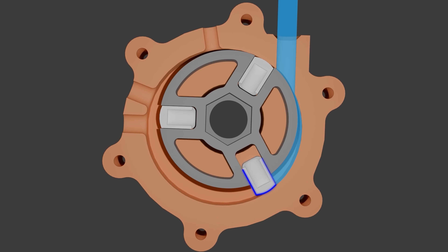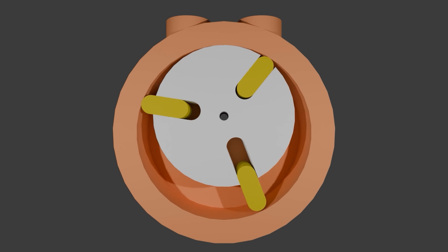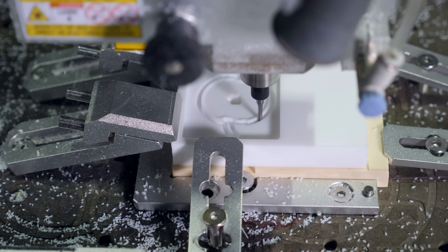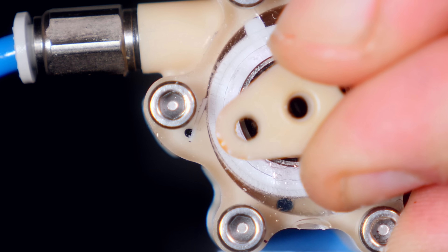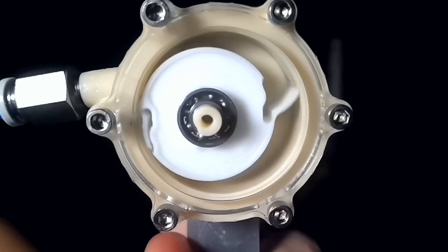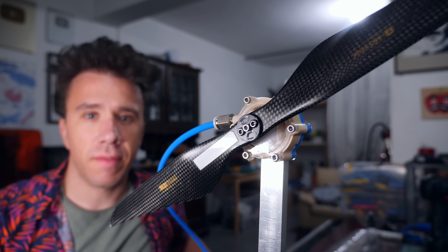Do you remember how I said this engine has too many spots where air can leak? What if I could eliminate some of them? This is a vane motor — it has vanes that slide in and out to compensate for the offset of the casing. What if instead of vanes, I machine flaps directly into the rotor? Not only would I get rid of a lot of leak points, but I'd get the same effect as the apex valve — if the air tries to escape, it seals the flap even more against the wall of the engine.